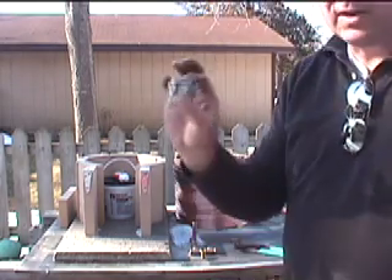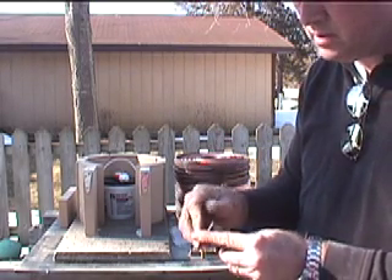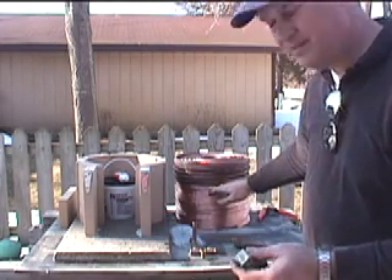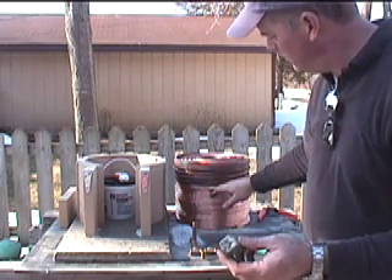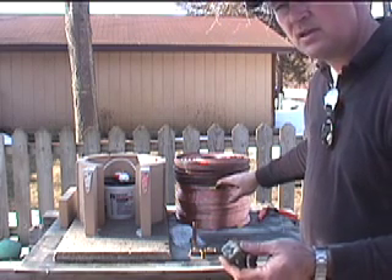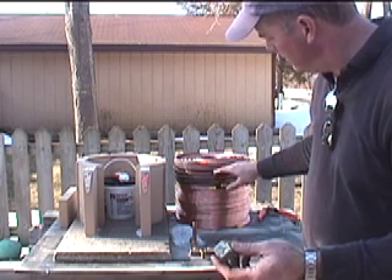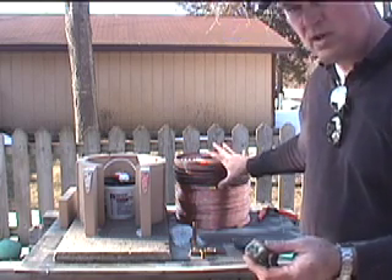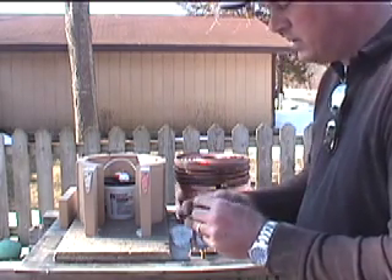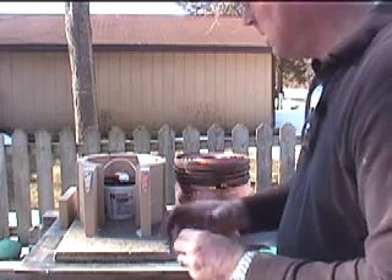This is the little circuit for the water control. It's actually got a delay circuit in it, so we can fill about three seconds beyond full. You can adjust this - if you wanted to fill one or two seconds longer, you'll always end up having a little bit of water in these bottom spiral coils. So we're going to be using this area to evaporate and this area to turn to steam. We don't really want to superheat the steam - not with these type of simple engines. Superheat is great if you're going to run compounds or triple compounds, but not for the simple engine.